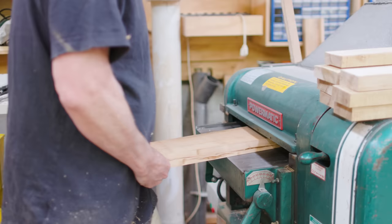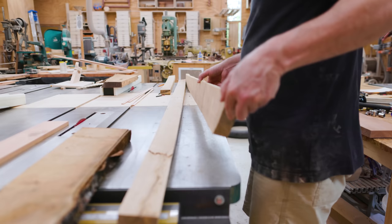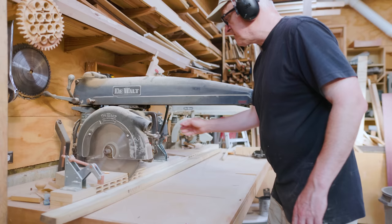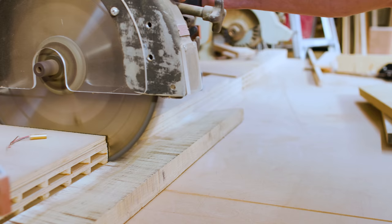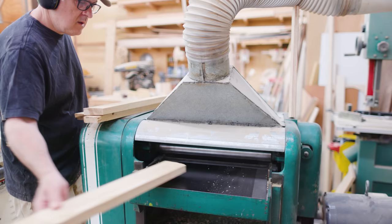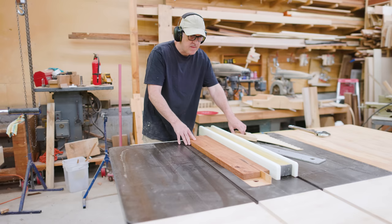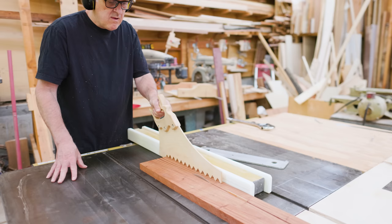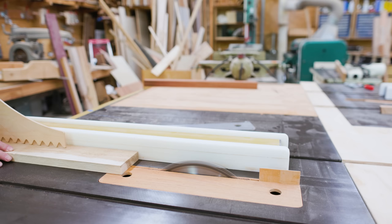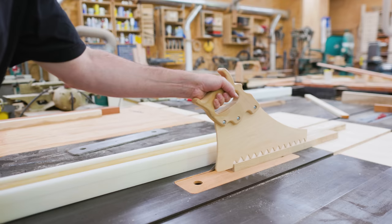I found some different small pieces that I have that aren't really going to be big enough for a bigger project — a piece of cherry and some of the oak that I cut up a few years ago. There are a few smaller pieces that are kind of twisted and would work well for cutting into small pieces. I cut those oak pieces shorter so they wouldn't have quite as much twist, and I could joint and plane them. And a piece of something darker — I'm not entirely sure what this is, but it was just a scrap piece in my wood pile and it was a good length. It'd be nice to have a little bit of something darker in the pattern. So I cut everything to the same width. All of the pieces are different thicknesses, but what I want is the same width out of every piece so I can glue them together into a single block.